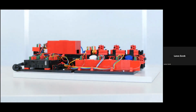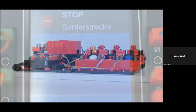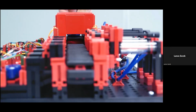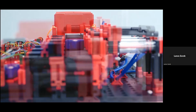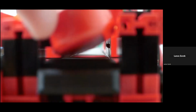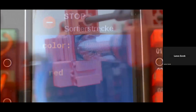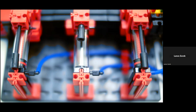The dimensions for this model are approximately 20 by 14 by 12 inches, and it has a weight of just about 10 pounds. Now, as before, the 24-volt version has a relay board for motor polarity reversal, and both a multi-pin connector, in this case 34 pins again with a grid of 2.54 millimeters, as well as additional PCB terminals with push-in connections for all inputs and outputs. And again, the end user must provide the PLC and the program. The 9-volt version again comes pre-wired to a pre-programmed TXT controller, and one 120-volt power adapter is required for that.